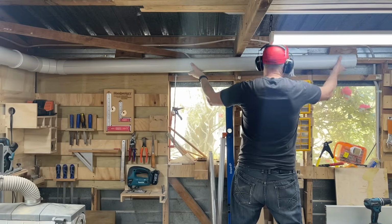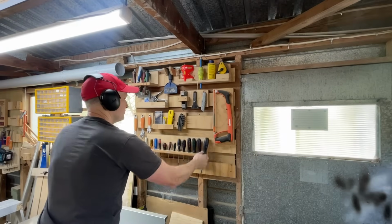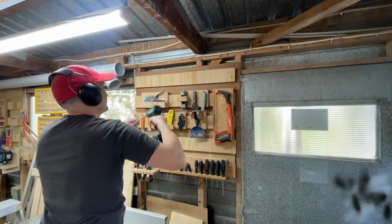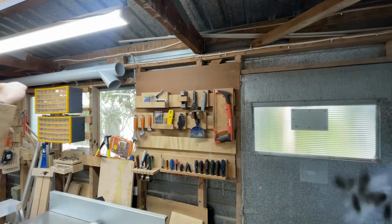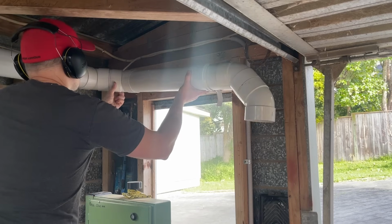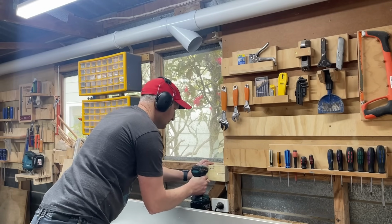Then adding the rest of the piping was a matter of rinse and repeat, adding Y connectors where I wanted to drop down to a machine and always using two 45-degree joiners for any corners. And for the final drop, I could just use two 45-degree joiners, as I obviously didn't need to continue the pipe on any further. Now I could run all the drops to the individual machines, which was super simple.